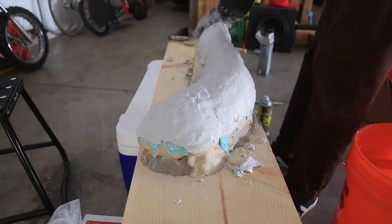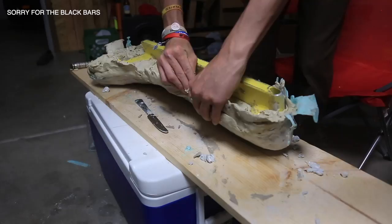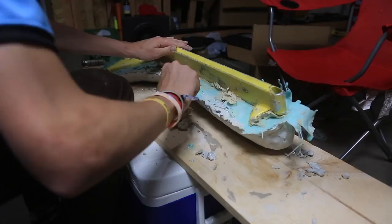I apply the free form air all along the deck trying to make it super smooth. I make sure I don't go over the midline or onto the clay because this mold is a half and the other half needs to seamlessly fit onto it. It's the next day now — I take off the clay. The clay is kind of hard to take off just because it likes to be in every single nook and cranny, so make sure when you take it off you spend a little bit of time and effort really making sure all the clay is off.